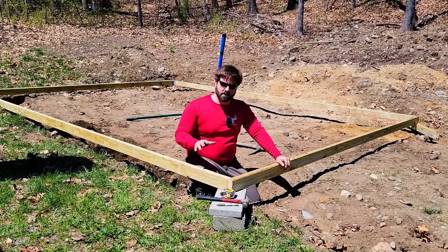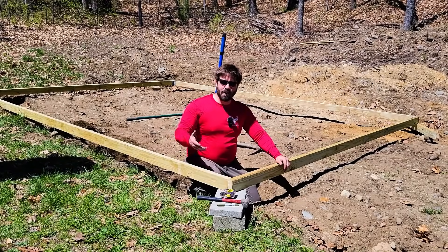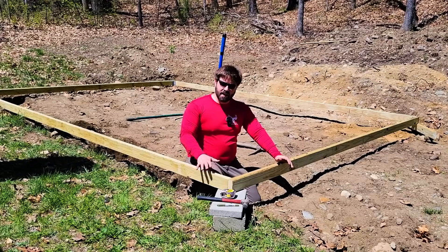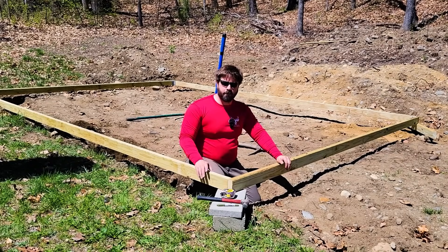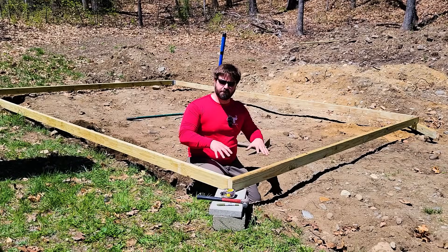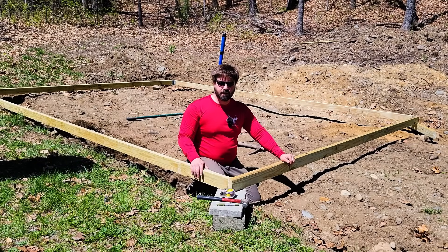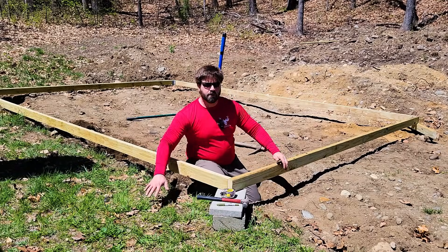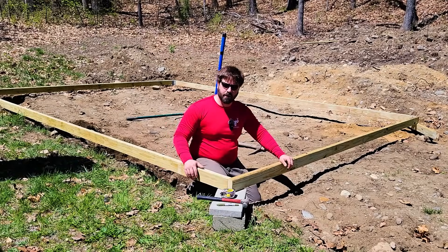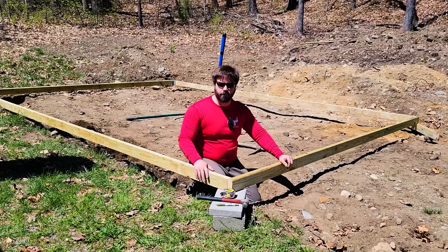I do live in the north where it gets cold. So if you were building a large building like a house, you want to be below the frost line, which is 48 inches in my area. In this case it's a very small structure, so I'm not worried about frost heaving, but I do still want to be below that organic material. When you build a foundation like this that is less than the frost line, it's called a floating structure. That doesn't mean I want to put it right on top of grass, because then it will decay and settle. So I still want to be below that, but I'm not going all the way down - not going four feet in this case.